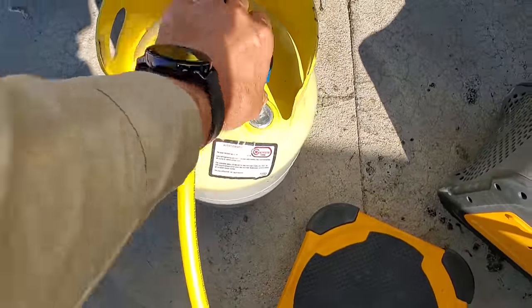System's open, nitrogen's flowing through. We're gonna go ahead and cut this dryer out. I sanded it up extra long. We're gonna cut it out because I wanna see if I can see what the restriction is. All right, we're gonna purge through the system. Let's see if anything comes out of this guy. It's a bunch of oil.